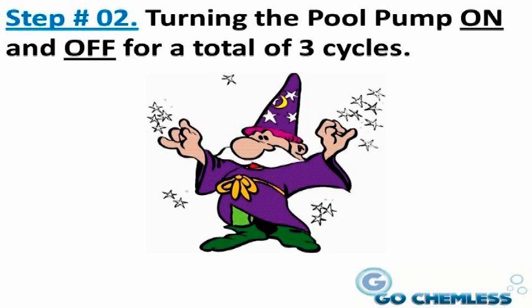You will then be asked to turn your pool pump motor on and off for a total of 3 times. This is in order to build a baseline of the pool equipment's environment. If you have a variable or multi-speed pool pump motor, wait until the warm-up priming sequence has completed before engaging the pump on learning cycle during this process.